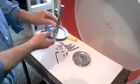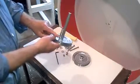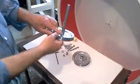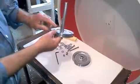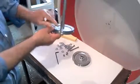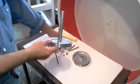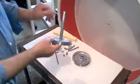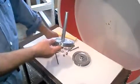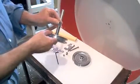Now, over on the inside, this is important. It takes about 6 washers to bring this even. I don't know how well you can see it, so that where this pressure is pushed on the bolt, you want it to match the end of the pulley. So on these particular pulleys, you need 6 washers. And I'll show you. 3, 4, what did I put? Okay, 6.